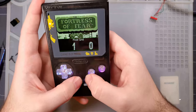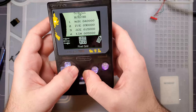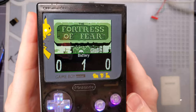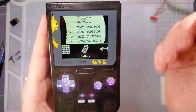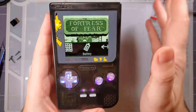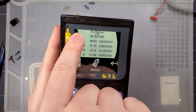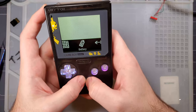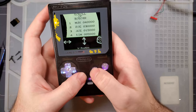Pixel grid is not something that KGSWS can adjust without reprogramming the FPGA — we only ever programmed the microcontroller. Next up we have the battery monitor, which I have left enabled. It doesn't show up because all it is is a low battery warning. As soon as my battery crosses the threshold from around 3.6 to 3.5-ish volts, I'll get a little battery logo up in the top left corner — which we might see by the end of this video because this battery is not very charged. I let it drain down until the warning came on, then charged it for like ten minutes.